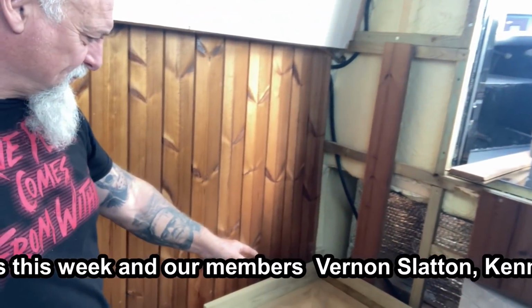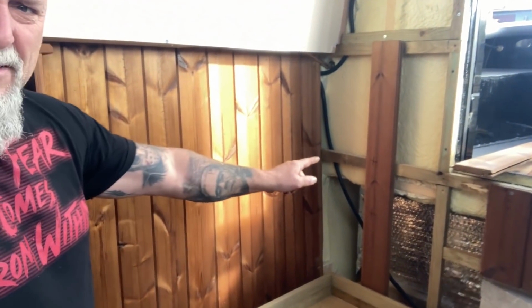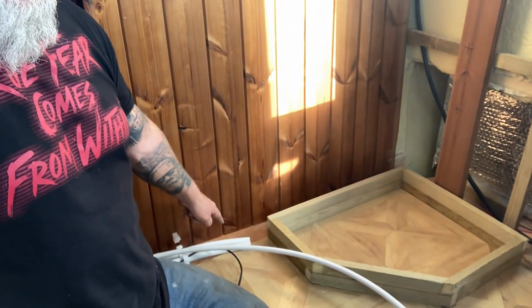Fending corner. I'm going to strengthen that, by the way. Right, scratching my head straight away. The idea is to go out to the back of the stove, a couple of bends, and come along and join these two plastic pipes. I'm going to do that in copper. I don't think taking plastic pipes to a diesel stove is a good idea. So probably a metre and a bit of copper before I go into plastic.